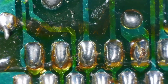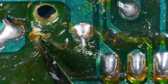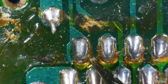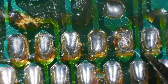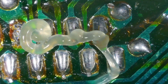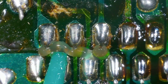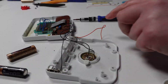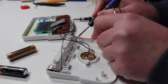Looking at these solder joints here — they don't look great but I think they're okay. There's a lot of residue on the board, and I don't know if that's from the factory or whether someone's had a go at repairing this in the past. But I think they're okay, and what I'll do is just run the iron over them. This wire's come off now as well, so I'm going to replace it. The wire itself has snapped — it's not the solder joints.